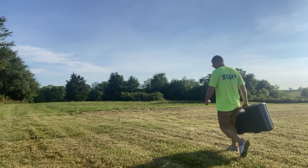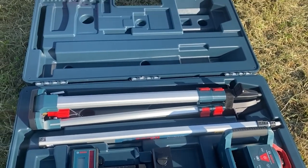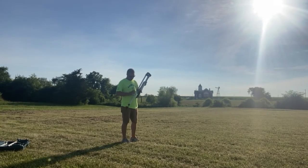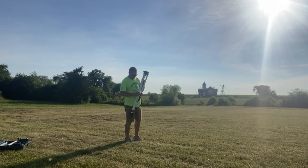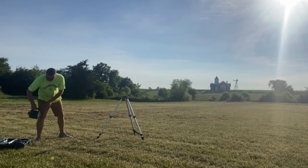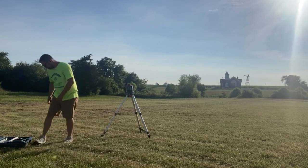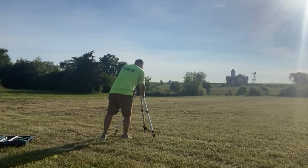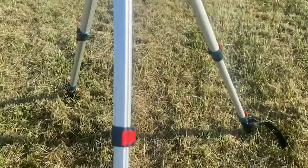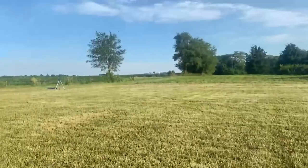Now you're going to hear the term 'fall' throughout this. All we're talking about is the amount that the elevation changes over a certain distance — usually given in inches or feet over 100 feet. Now what I have here, you're going to want to get one of these as soon as possible. You're going to use this throughout the build. It's called a rotary laser — some people call it a laser transit. We bought this one at Lowe's. It's a Bosch, a 1,000-foot rotary laser. You're going to use this from everything from the foundation to the septic and all throughout the build, so go ahead and get a good one.